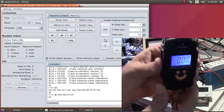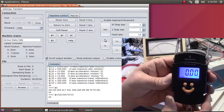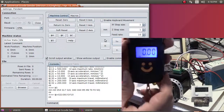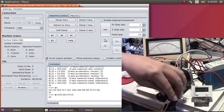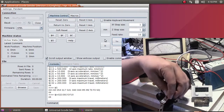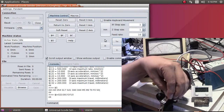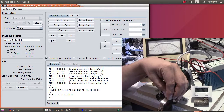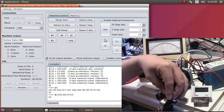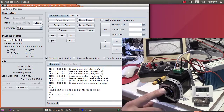We're measuring in pounds. I'll put the arm about one inch from center and pull down with the luggage scale to measure the holding torque. This is a primitive method but it shows real performance. I'm about an inch from center — remember we want 16 pounds here. Pulling down... I'm at 9, 12... I'm at 16 pounds right there. The current draw at 16 pounds is about 400 milliamps to hold it. This motor is going to work fine for our application.